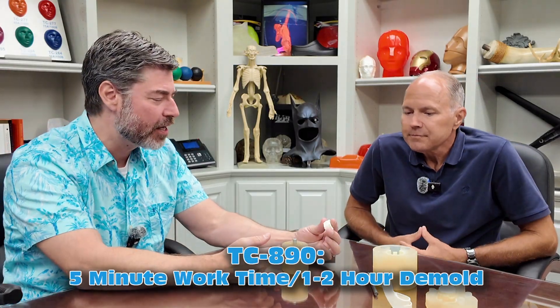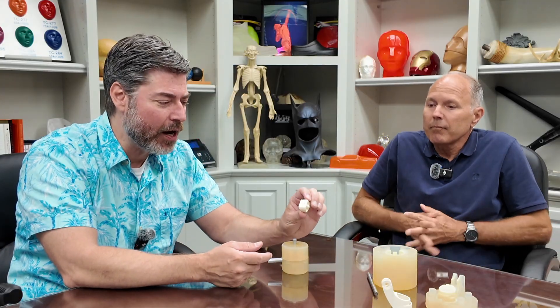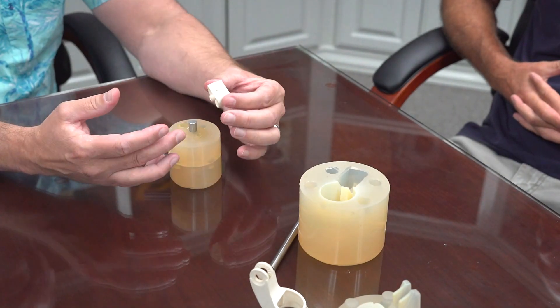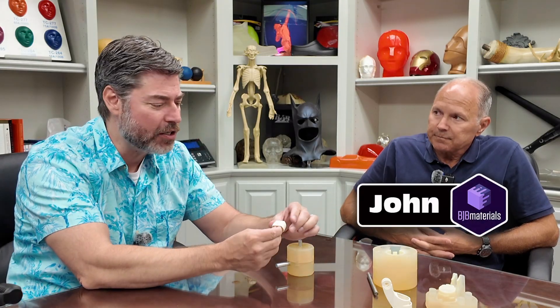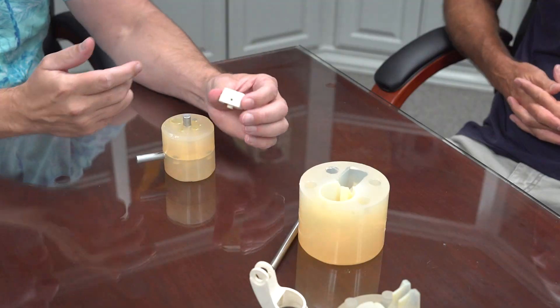This is the kind of thing that in the prototyping world, you're simulating ABS. And this — was this an SLA part? Yes it was. So this is an SLA part, and this is one of those things where SLA parts, any kind of 3D printed parts, this is where this kind of mold making comes into play when you obviously don't want to be printing each one of these. It's like baking cookies one at a time. The benefit of marrying this up with 3D printing is you get to pick out the physical properties that you can't necessarily pick out with an SLA material. So you've got this SLA pattern — you make the mold of that.